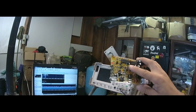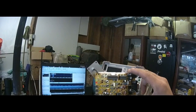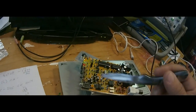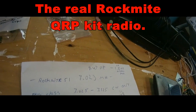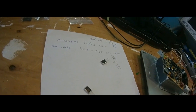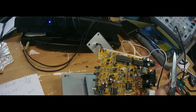What I read on the internet is that I could recrystallize the radio for frequencies between 7.025 and 7.125 MHz. I went on eBay and bought a set of crystals from a company called QRP Me, which makes little kits like these. I cannot use the 7.015 crystal, but 7.030 is on the very edge of what I could use. I could plug in one of these crystals in place of the existing one to change the transmitting frequency, which will make me 100% legal.